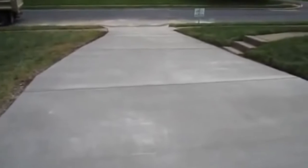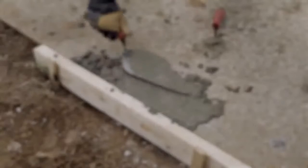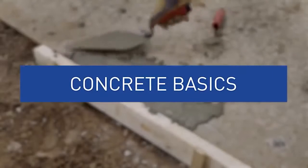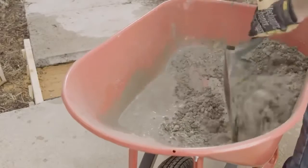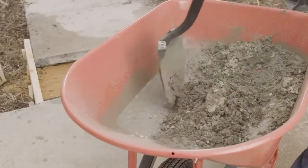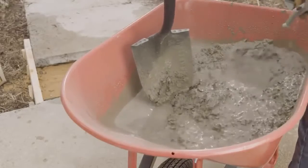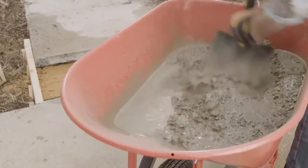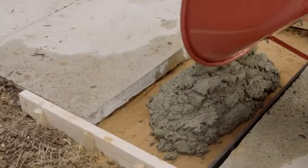So we're going to go through some basic sidewalk repair and show you that with a little know-how and some standard tools. Concrete is a composite material made from a few different elements. A mix of fine and coarse pieces is held together by a liquid cement binder. Getting the right mix of water and concrete is key to the right strength and drying time. Check your package instructions, but generally you're looking to create a peanut butter consistency.